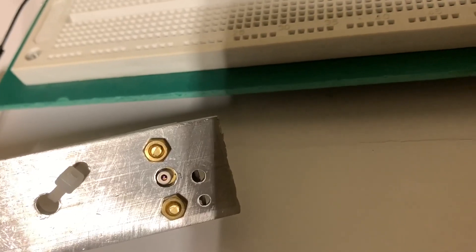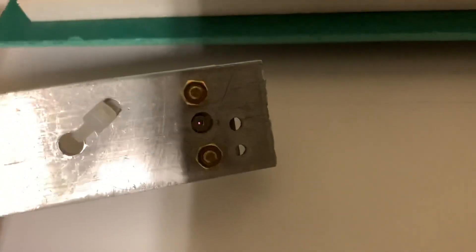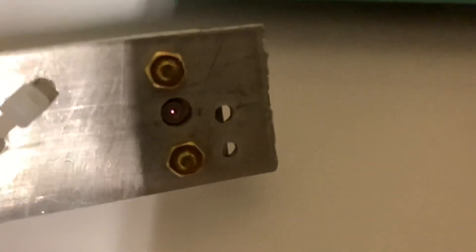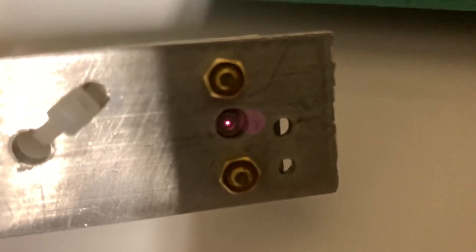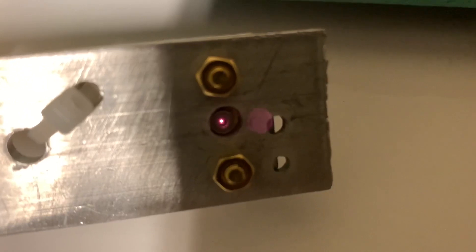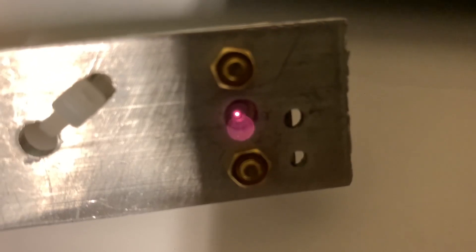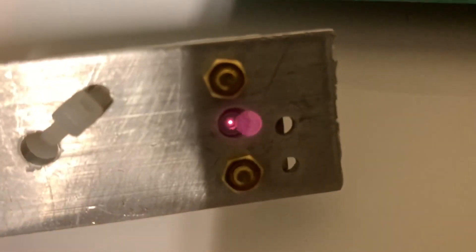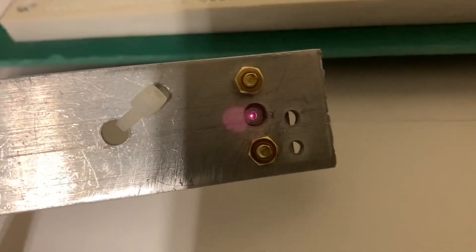What I'm doing now is I'm increasing the amount of current going through it until I get maximal brightness. You can see it's getting brighter and brighter as I increase the amount of current at the same voltage flowing through the diode. This driver circuit seems to work pretty well, and the phone is sensitive to the infrared, but not that sensitive to it. It's continuing to get brighter. I'm going to connect a focusing lens to it and see if we can actually burn something with it.